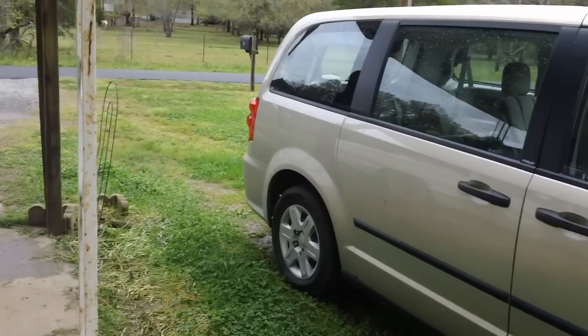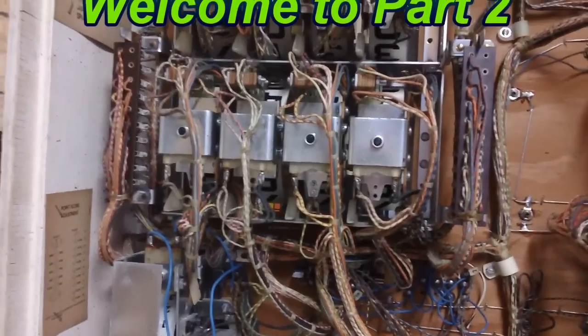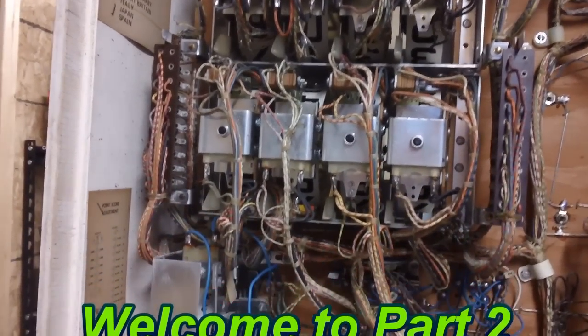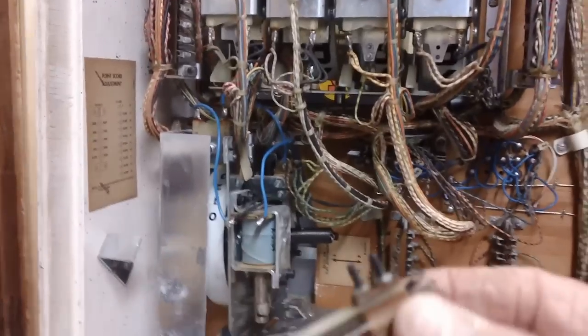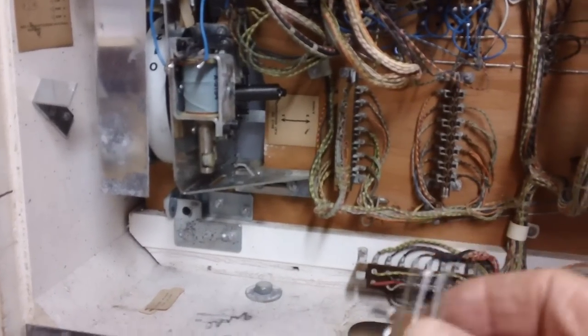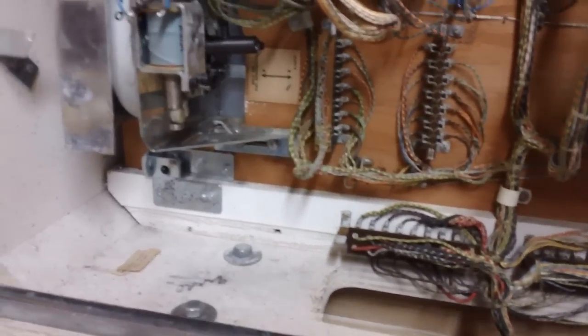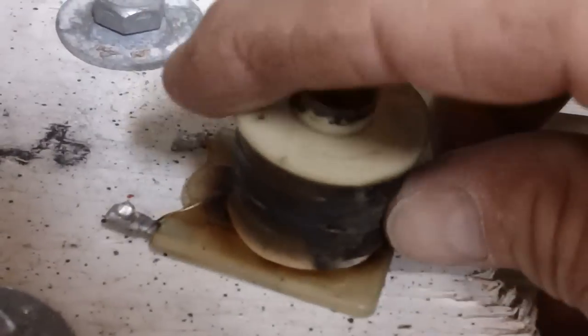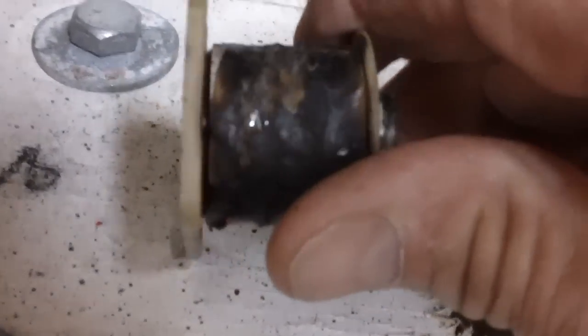It's worked these many years — never got near the house. I went ahead and made the repairs to the back of the pinball machine, our Card Whiz. You'll remember it had a bad set of contacts here — these were not the right kind, not long enough, and they were burnt and fried. Also, the coil for the solenoid — check this out — the coil for the solenoid was also fried to a crisp.